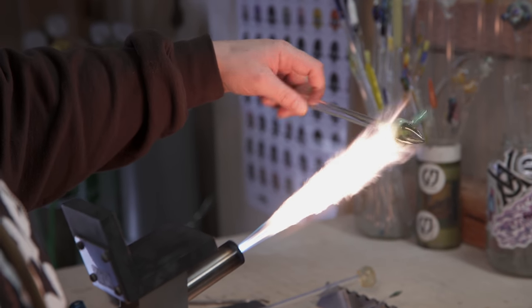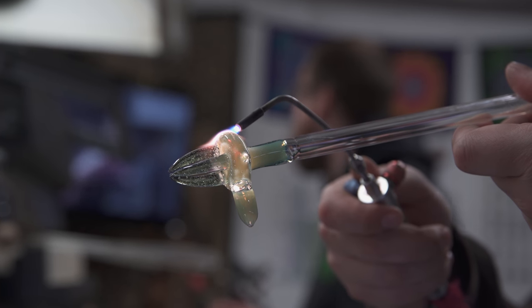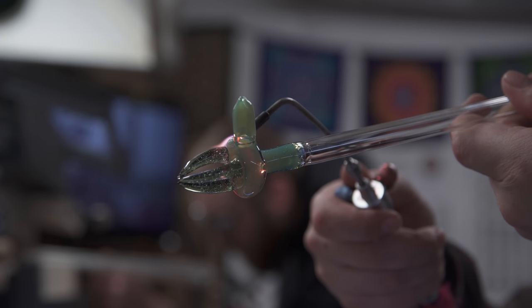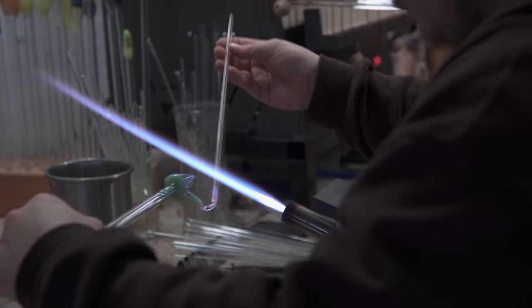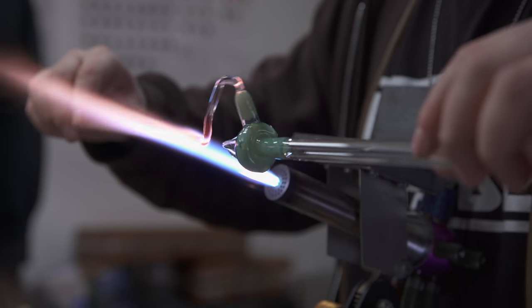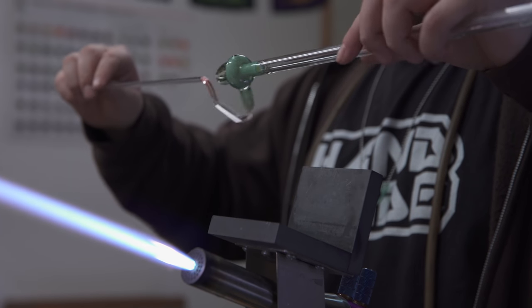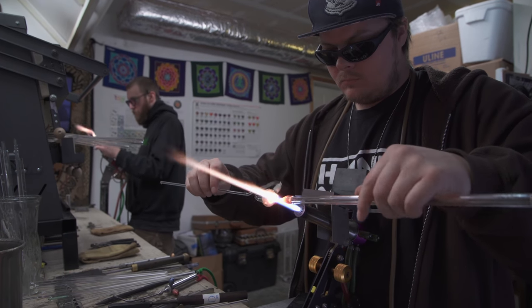And we're gonna put a punty on that tube end, kind of wrapping it around our work, getting it centered so that we can move the handle. You don't have to insert these perks on a punty rod, but I prefer to with the holes for the perk already popped. Makes the weld go a little bit quicker, and I don't actually have to pop the holes inside the tube. But just get it as centered as you can. It doesn't have to be perfect.